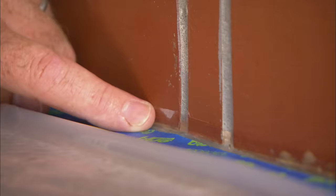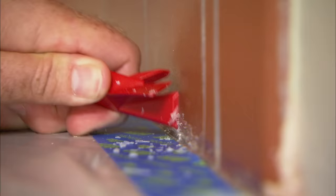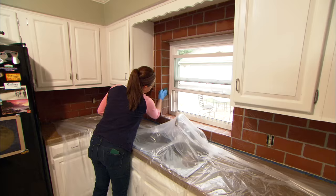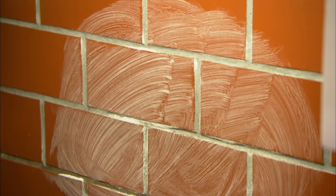It's going to be a lot of prep work before we can do this, so let's clean off the counters and get started. We've protected your granite countertop with a plastic drop cloth, and now we've got to clean the tile. We're going to start with a kitchen and bath cleaner — a bleach and water mix from a spray bottle — then scrub everything with a scouring pad. We'll take a little extra time behind the stove because that's typically a spot with more grease on the wall.